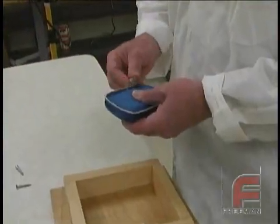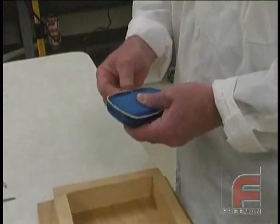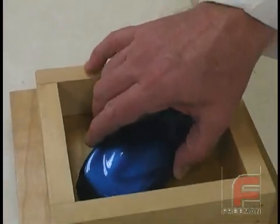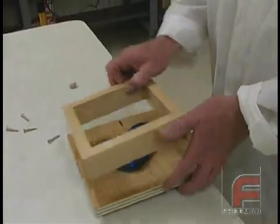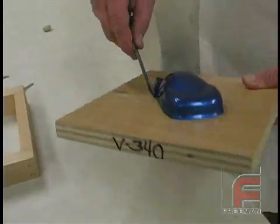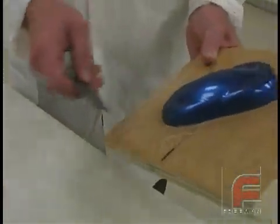In preparing a silicone rubber mold, we are first putting clay around the edges of our model to make it adhere to the moldboard. Next, we align the model in the center of our mold, remove the sides of the mold, and then press the model onto the wood. Next, we cut the excess clay from the edges of the model.